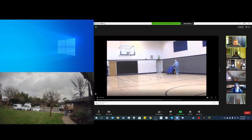I want to point out something. When they're doing a preparation to restore the gloss on a gymnasium floor, it will look unevenly dull, okay? Because imagine we're sanding, in a way, the top surface, because a gymnasium floor, unlike a wax floor, is made with a very hard polymer called urethane. It's a very thick coating, and as a result, that urethane coating won't stick. If I just put it down on an existing one, it'll peel off over a very quick time, usually within a matter of weeks. So it has to be prepped so that the floor will accept it. It literally is being sanded rough and all the dust and oils removed so that it will allow the new coating to go on to it.